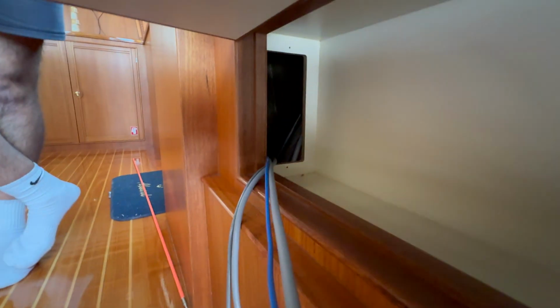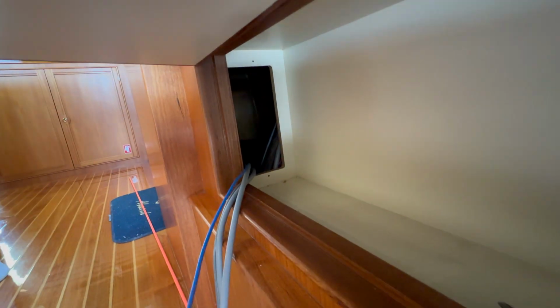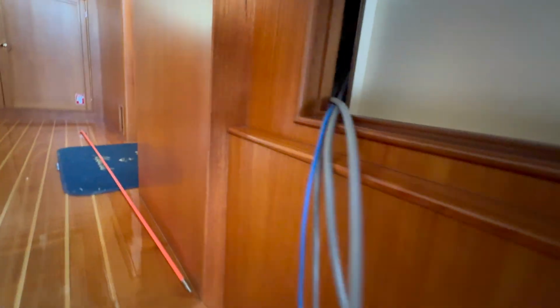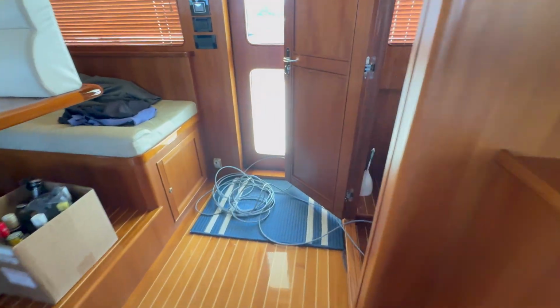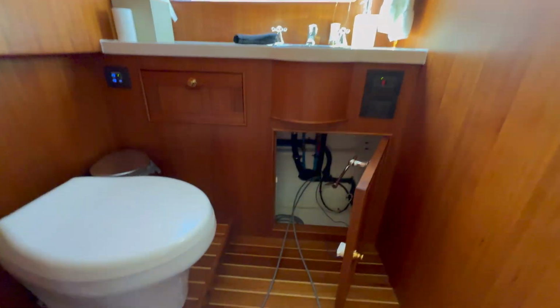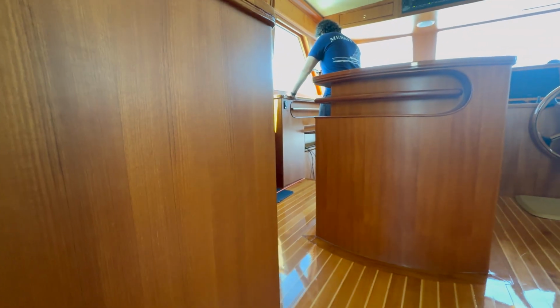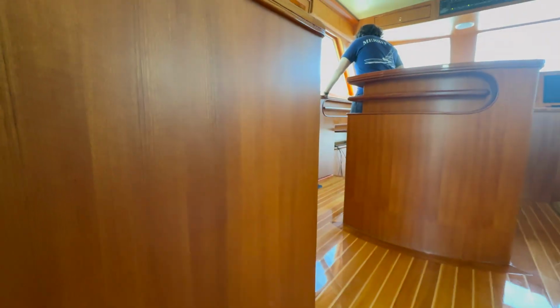All right, we pulled the cable back from that port wing, so you could actually see our pull cable here, and I pulled it back with this because we're using one continuous length of comm cable, which is the NMEA 2000, so the network cable. So now I have majority of it sitting here, which is uncut. So now we have both cables here. Now we need to pull this from here back into that corner over there, which Nicholas is going to pull. Go ahead, pull, Nick.